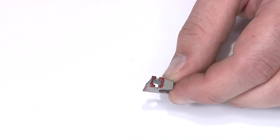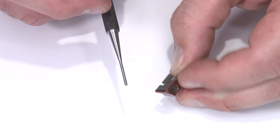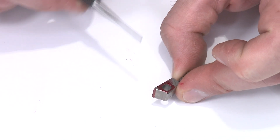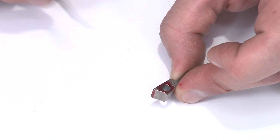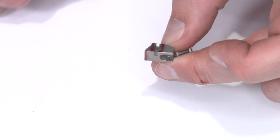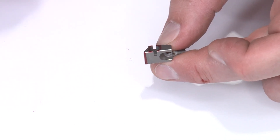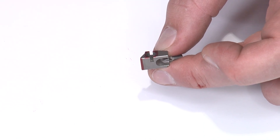You can see the red marks on the sear — I put red ink on the spots that need lubrication when you reassemble. On both sides where it rubs in the housing, and on the top section where it contacts the striker, apply lubrication. The rest can be left un-lubricated; there'll be enough lube floating around your gun.